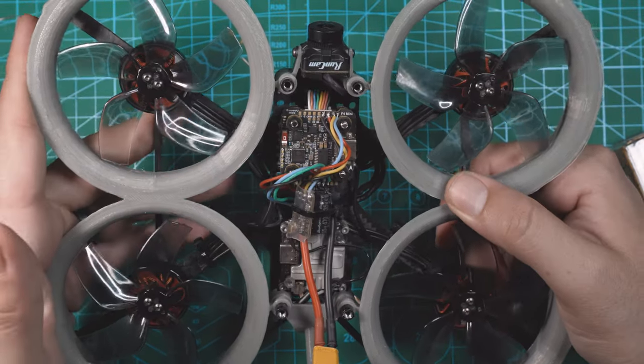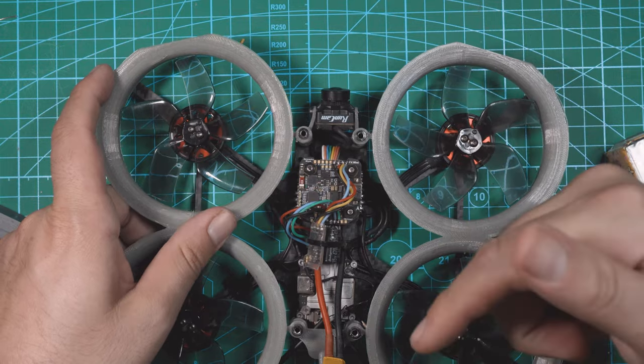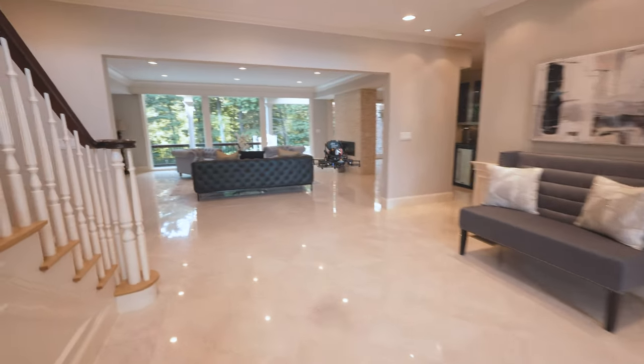Overall, seems like a solid stack. I have quite a few of their F405 V3 stacks and an F7 stack in one of my CineLifters, and they've performed awesome — I've been a big fan of SpeedyBee. This one is right in line with their other stacks. The Bluetooth makes tuning really easy; without it I'd have to remove the ducts, take off the top plate, plug in USB, put it all back, go fly, and repeat. At only $59 in 2023, it's a pretty great deal. If you have any questions about the SpeedyBee F405 Mini, leave a comment below.